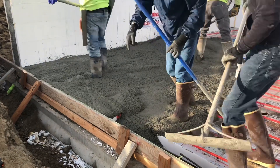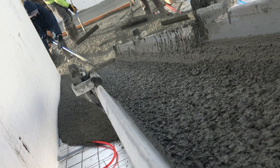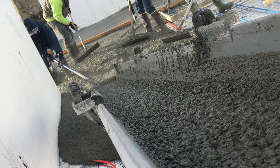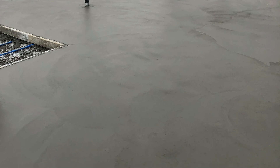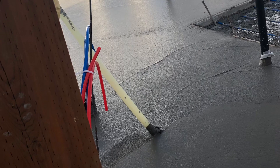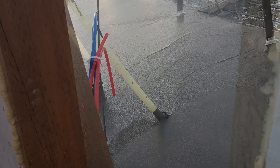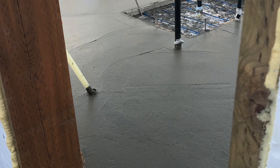You can see in the background there is a form laid out to create a void in the slab, and that is for my walk-in shower. I did a curbless version, so I just wanted to make sure that the concrete was not there so that I could do my sloped pan. And that's the end of this video — the next one is framing the roof. See you soon!